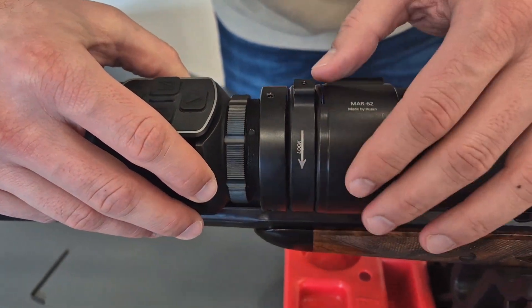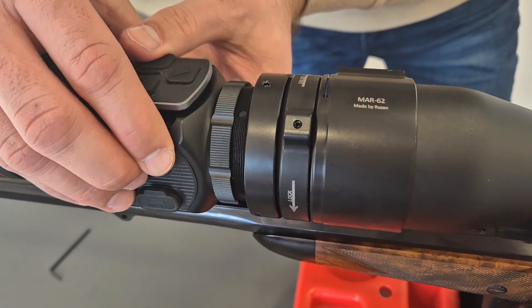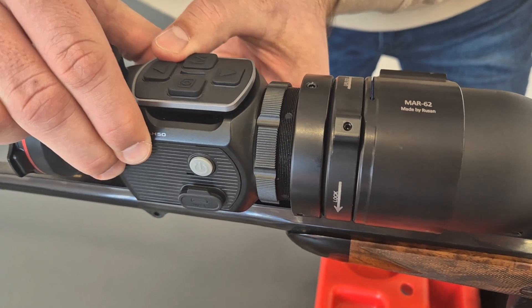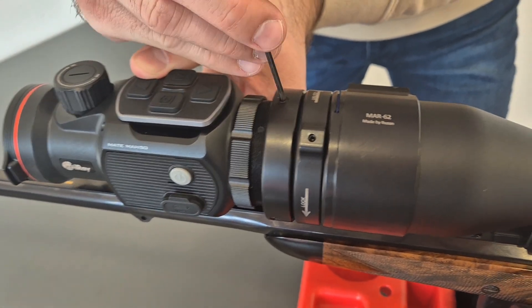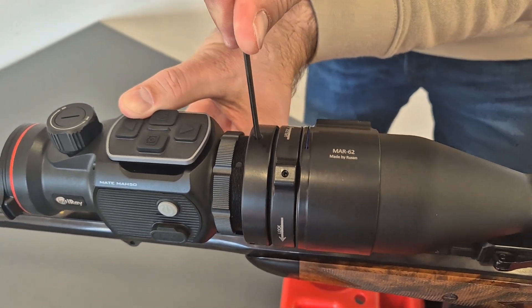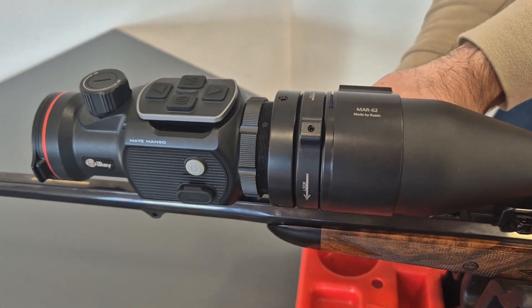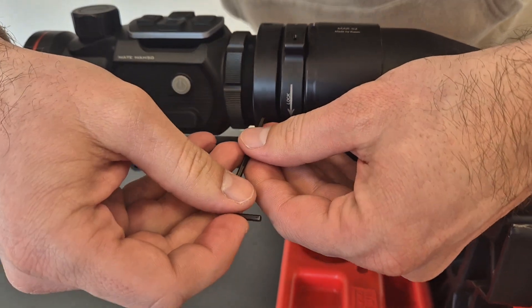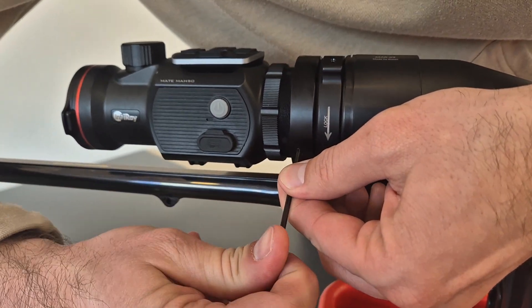After you connect it on the adapter clamp, you orientate the device as you wish. Then tighten screws with moderate torque, approximately 1.5 Nm. You can power on the device to check if it is aligned correctly to the horizontal line. If necessary, you can again loosen the set screws and make a correction of the device orientation.